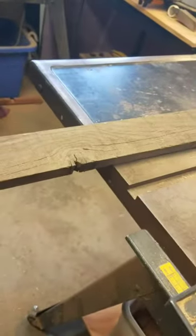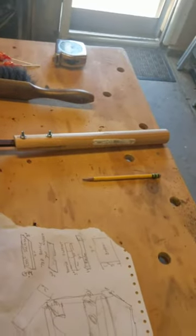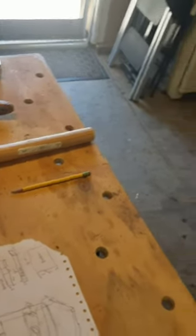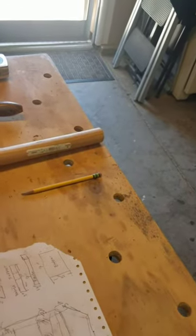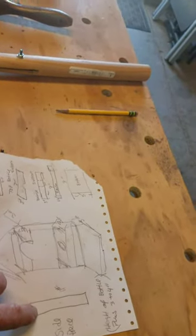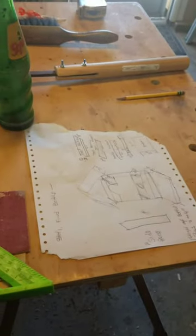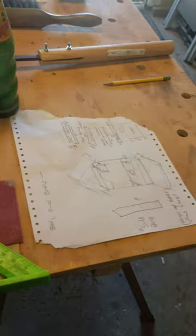We're going to make a lot of these pieces and then start showing you how to put this thing together. I've chosen this bottle right here. I've measured the bottle and added four inches to the side pieces, which are going to be 14 inches. So I'm going to make two 14-inch pieces for the sides — that's how we get the right height proportionally for this little house that goes over the bird feeder.